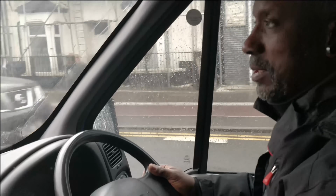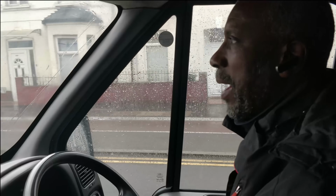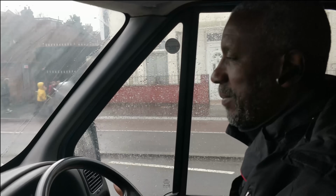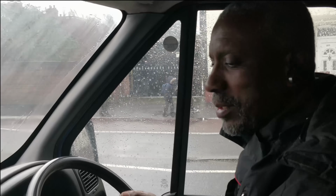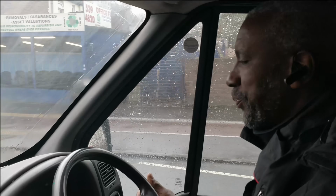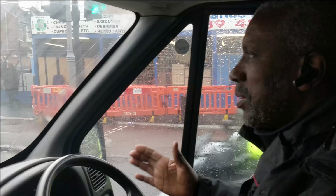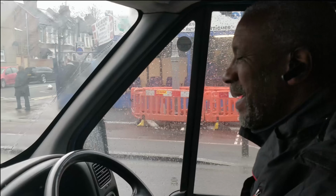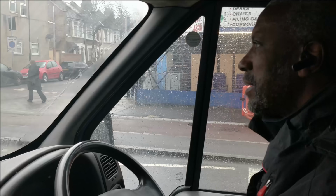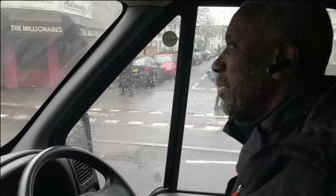Yeah, when you go into these jobs, like this person said they've got no power, a lot of the times what I've found, it's usually just the RCD that's tripped. Nowadays you've got the split board with 2 RCDs and your MCBs. But when I do rewires now or install new fuse boards, I always recommend RCBOs.